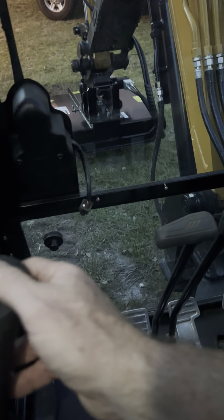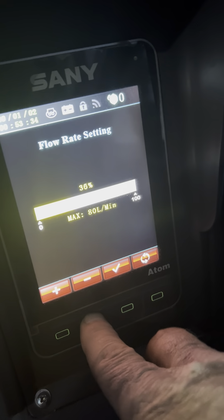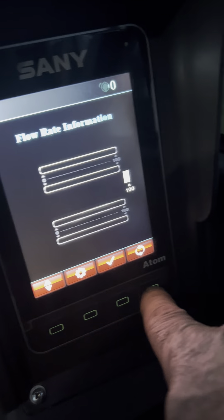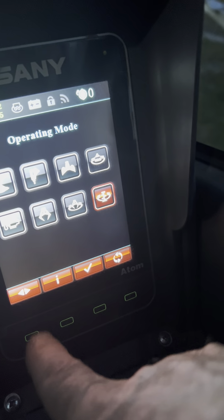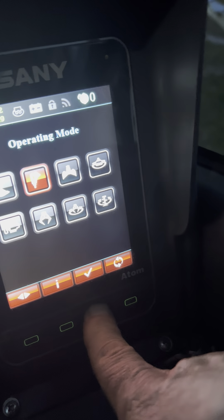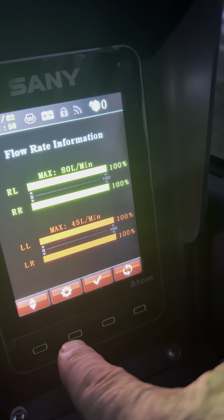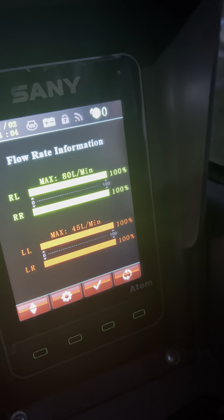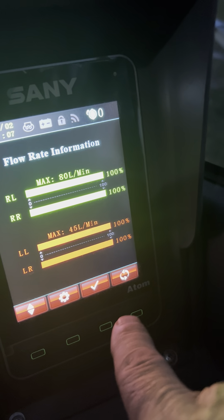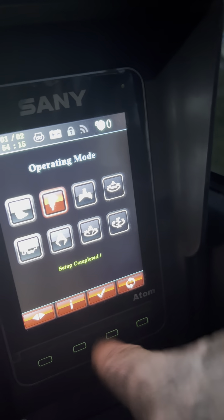The cutter head moves but I lose my thumb functionality — I didn't mention that earlier. That's the same for the auger, grapple, and whatever that other mode is supposed to be. In hammer mode, I select hammer mode and go into the info screen — you can see it's got flow all the way, because I've turned the block in the back to the right of the engine so that it goes to the return-to-tank side. So I didn't have to do anything to the flows there.